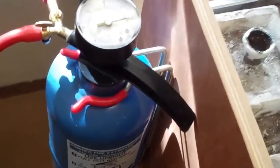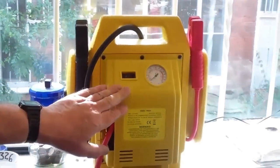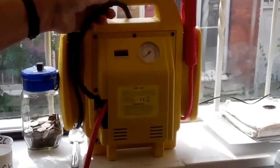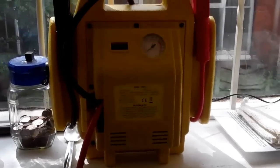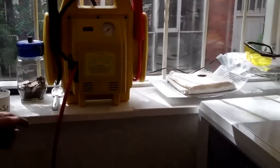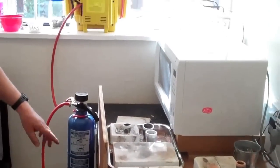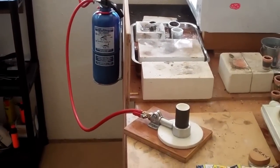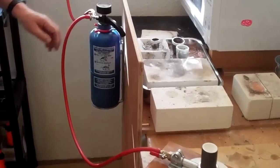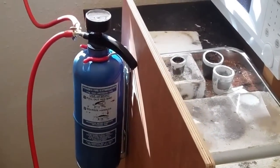The vacuum pump is a quick DIY conversion of a standard little compressor, which is a non-destructive conversion — it's still your useful compressor to have in the back of the car. We've tapped onto the intake side, which works quite nicely. Actually it pumps up this little tank — an old fire extinguisher tank — up to our 20 inches of mercury in just over a minute.